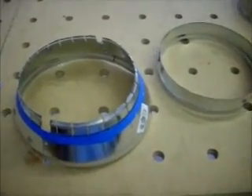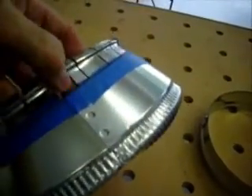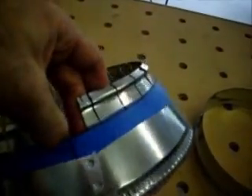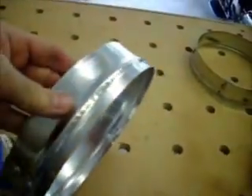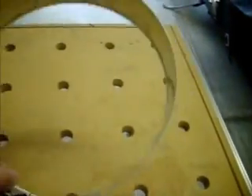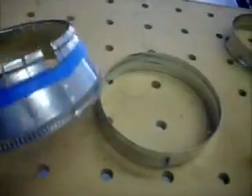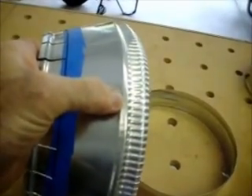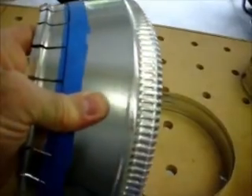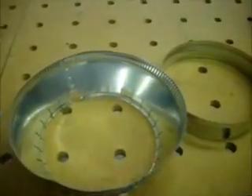Here I am in the middle of my setup. You can see the center cone — I marked off how far down I figured I had to go to get my eight-and-a-quarter-inch diameter to go around the outside of the trommel. I took the ten-inch band, drilled out the pop rivets, put in new pop rivets, and reduced it down to eight and a quarter — that will be my new band. The old eight-inch band was too small. I'll end up cutting this part off right about where my thumb is, which will give me a base that's nice and rigid to wrap the sheet metal on the inside to get my six inches. We'll see how it turns out.